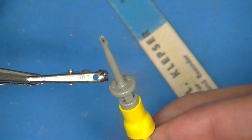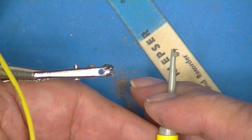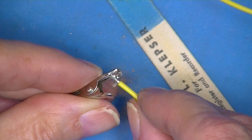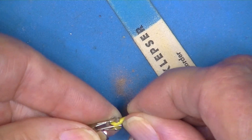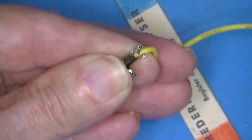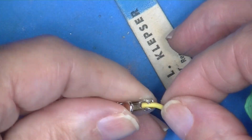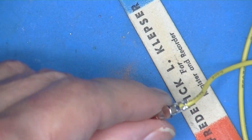I've got some 22 AWG with one of these on one end. I'm going to put the sleeve on the wire first - I forget that a lot. What I do is stick the wire through the hole and then bend it over. I don't quite solder it yet. Keep it down there, bend these little tabs together. I'm going to do that enough so that it secures the wire a little bit. At that point you can do your final closing.